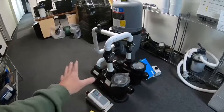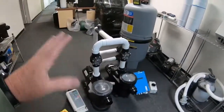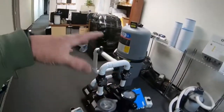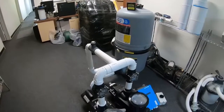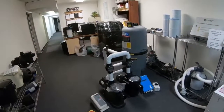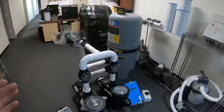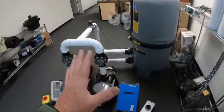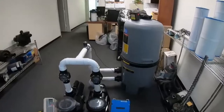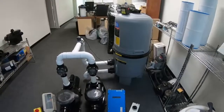Typically every single day the DC pumps will turn the AC pumps off because DC pumps are very efficient — they have unbelievable flow rates to achieve a lot of water environment needs. You can always add extra solar pumps and extra AC pumps if you have a high flow requirement, like 200 gallons a minute. The solar pumps will pump however much they can throughout the day. On a very cloudy day you might get 30-40% savings, and on a super sunny day you'll get 60% savings.